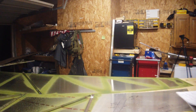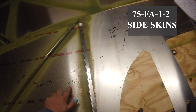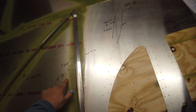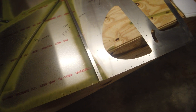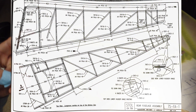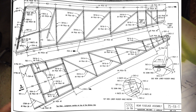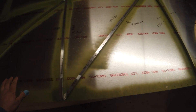I did this exactly like I did the bottom of the fuselage build. I went through and marked where all of the parts go, just like I did on the other video. Foxtrot 18 Tac One — our flange is facing forward, our holes are on the rear. So I can't mess this up; it's very Barney-proof. You're going to want to look at your plans on 75 Foxtrot Alpha Tac One. Those dark black lines on each of the longerons and L angles are the flange, and that either faces forward or rear.